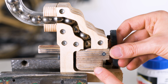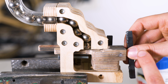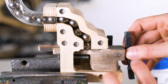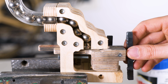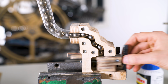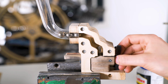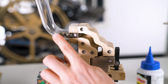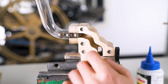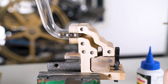It takes more force to open the gate, but in this direction the Marble Machine X is strong. It's the programming wheel pulling the gate open. To close the gate, we have only a spring, and the Marble Machine X is weaker. The fact that these 3 marbles are not feeding in this 90-degree configuration is by design. It's not a problem because there will always be more marble on top in the Marble Machine X.